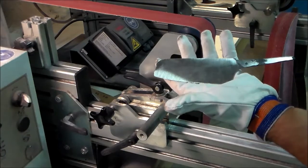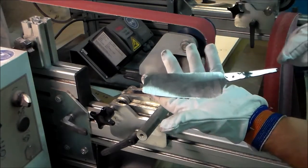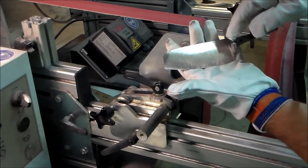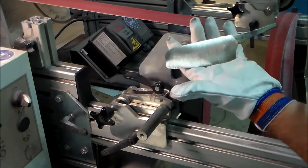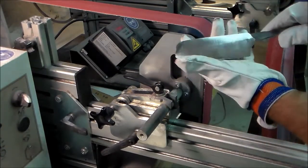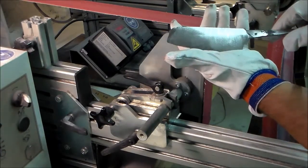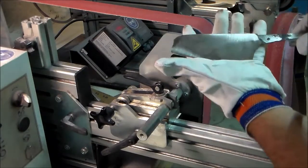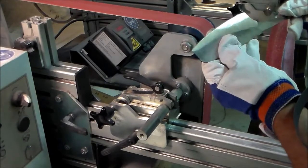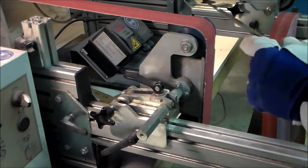But the problem is that every time you hit it with a hammer, there's a slight drawing motion as well. So if you hammer one side more than the other, then the core layer will become sloped or S-shaped or deformed in a number of possible ways, depending on just what your hammering technique is and how many times you hit which side. But this does seem to be okay.